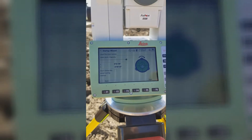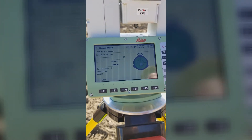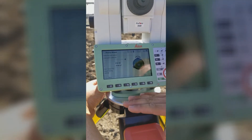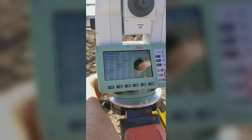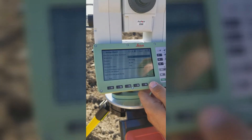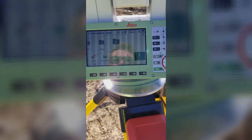Upon startup with a TS-16, I have it set to first give me a level screen. As you can see, it's showing you which knobs need to be turned. I have the face plate aligned with two screws — it's telling me to turn that screw just a little bit. Then I'll hit next. Temperature and pressure, next. And now I'm going to show you the autopilot setup.